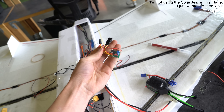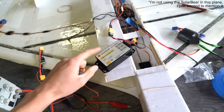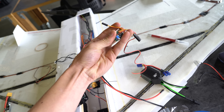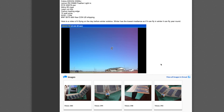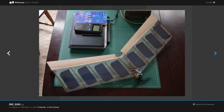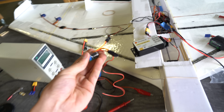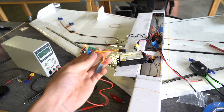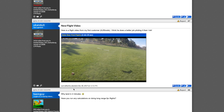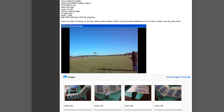There's another type of MPPT controller worth mentioning called the Solar Bear, which I learned about from RC Groups. Instead of a battery, this charge controller adjusts the throttle signal going to the ESC to track the maximum power point. It's not ideal for a large plane like this where I need full throttle control, but for super small solar planes that don't need full throttle control it works out well. If you're interested, search for 'solar bear MPPT controller' on RC Groups.